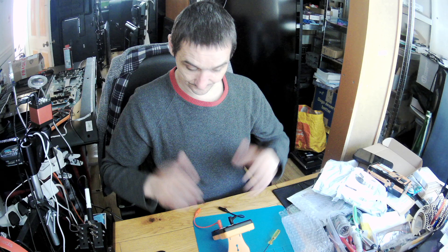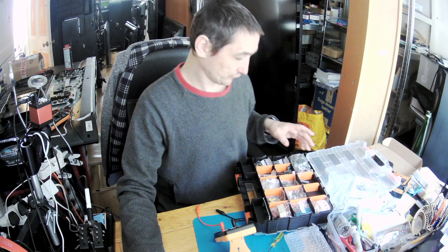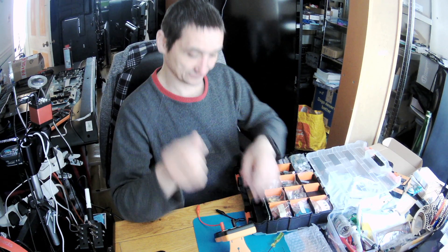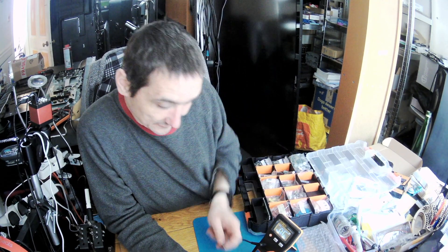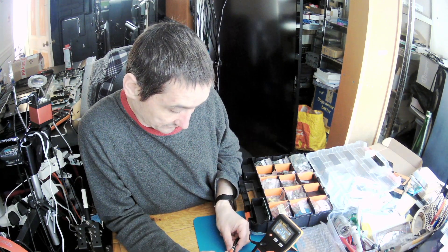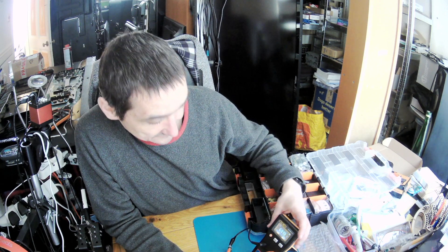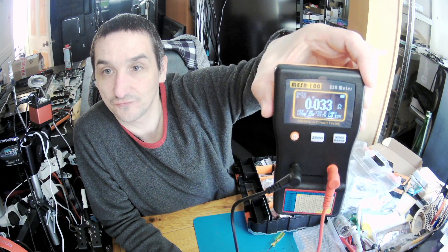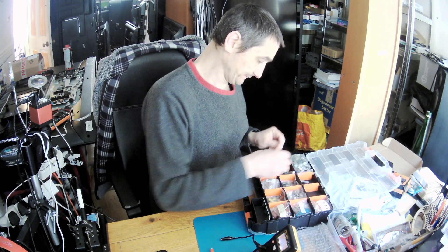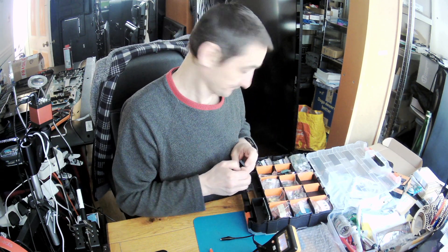Here's a reference 25-volt e-cap — a good cap with low ESR. Let me get a few caps from down here. So I'll do it like this: minus to the minus and positive to this. That reads 0.033, which is low, low ESR. Some of the caps I bought are low ESR, some of them are not.